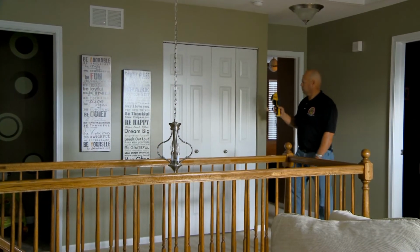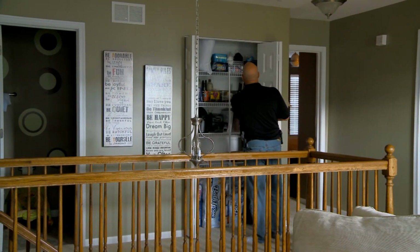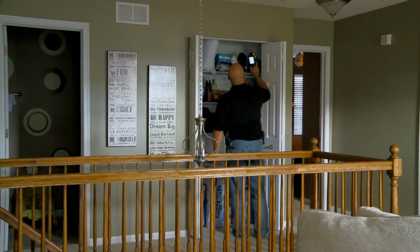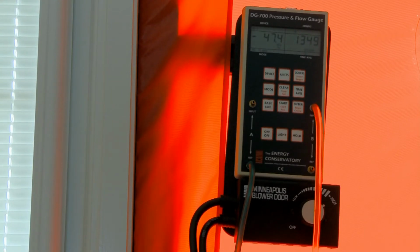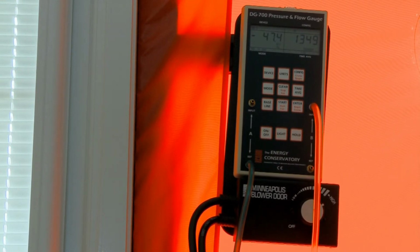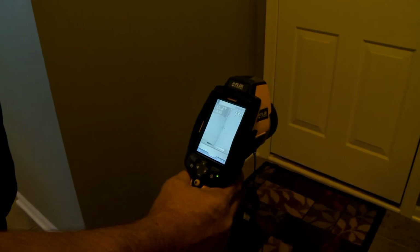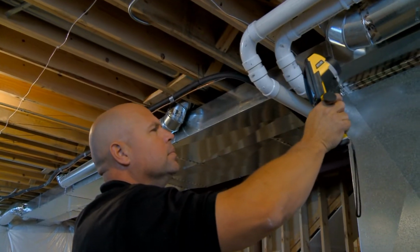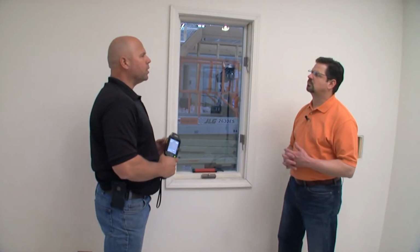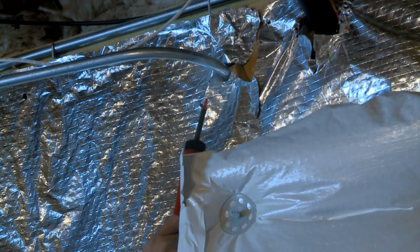It's showing the heat that's basically resonating from our drywall. Right. So with our blower door running and pulling in that exterior air, it's going to warm up or cool down our building materials. Then I'm able to go around and check the entire building. This is going to save a lot of time doing destructive testing trying to find out where that air is actually leaking from. Say, but basically you're able to pinpoint the locations rather than open a larger area than might necessarily need to be.